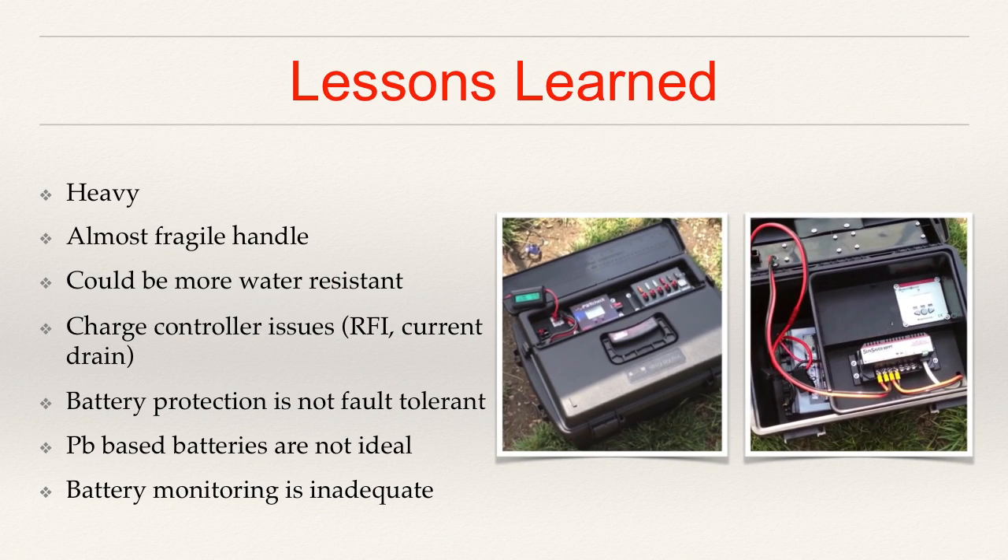For those who don't know, my previous battery box was built using two 20 amp hour AGM batteries. They were installed in an MTM Spud 7 case, or Spud 6 — I can't remember — but it's a lightweight plastic, slightly water-resistant box. To serve as charging facilities for the box, I installed a SunSaver Maximum Power Point Tracking charge controller with a pretty nice little display battery monitor. I threw several other gadgets in there, including a Rig Runner and a West Mountain Radio power check. Basically, this is the unit that serves as the prototype for my portable operations.